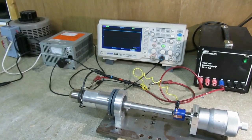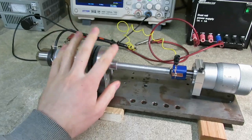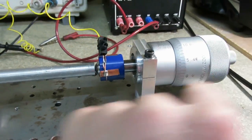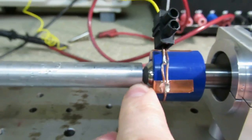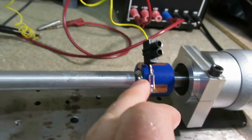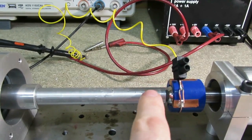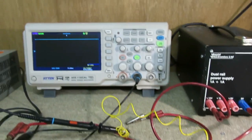Here's my attempt at measuring the vibrational amplitude of my ultrasonic horn. I've got the horn mounted on a rigid steel base plate, and a very accurate micrometer head moving a large steel ball bearing so it can be brought very close to the end of the horn. The ball bearing is biased to 15 volts through a 47k resistor, so when the ball bearing touches the horn the voltage drops to zero — they're shorted out, and that can be detected with the oscilloscope.